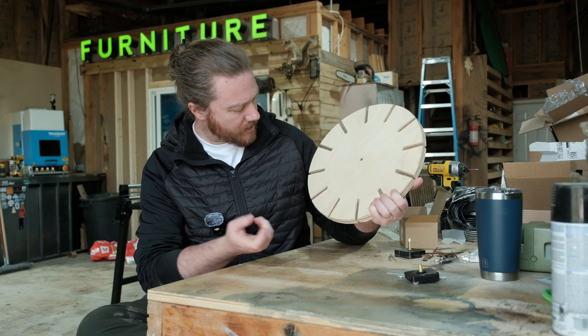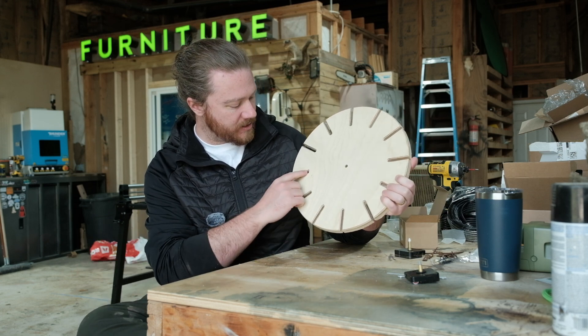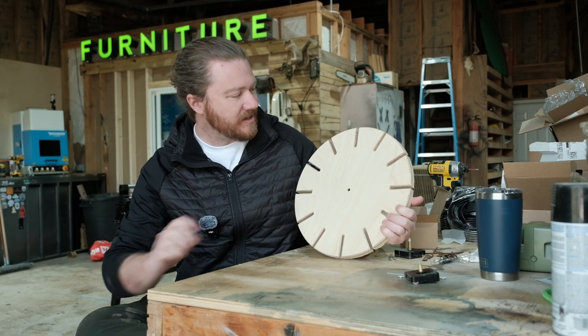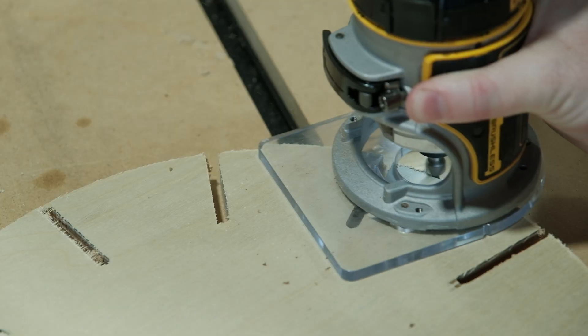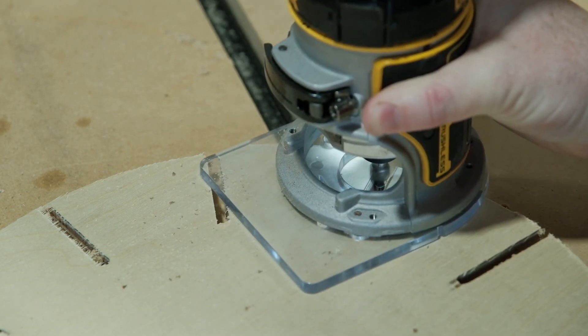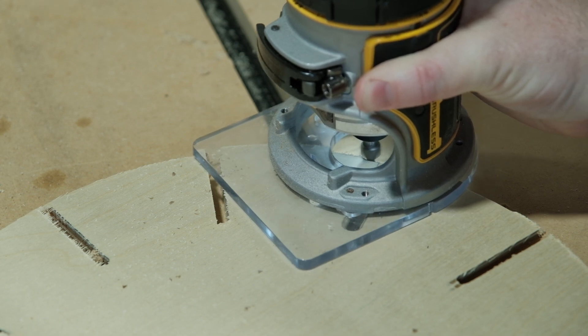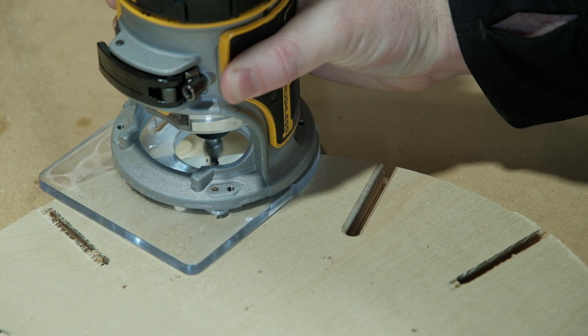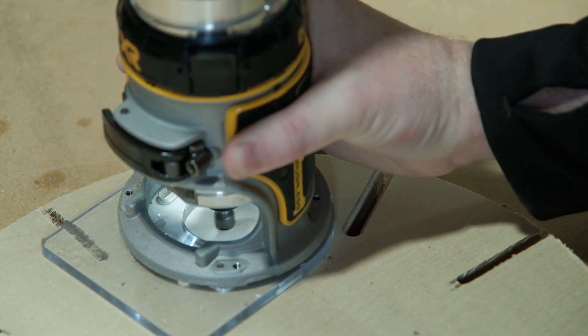The double-sided tape trick worked pretty well. There are two very tiny places where the bit was doing its job pushing downward and we did get a little bit of chip-out. I went back and rounded over everything with a 3/16 inch round-over bit — it is a very tiny micro bit — so even when we're doing profile cuts like this with our quarter inch bit, it still has a bearing small enough to fit in there and give everything a nice round-over.